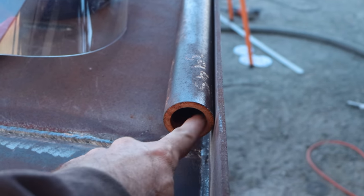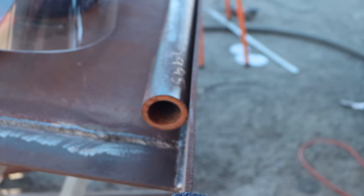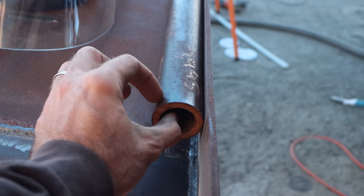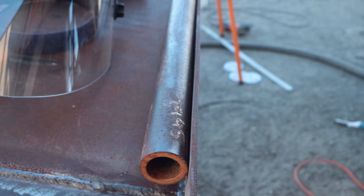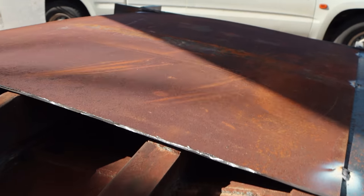It's about 0.5mm too small, so it's very, very close, but we're going to just cut it to size and then ream it, and that's going to end up being the end that we need. So it's not hugely thick in this dimension, but because there's so much length that's going to be taking the strain, it'll be okay.